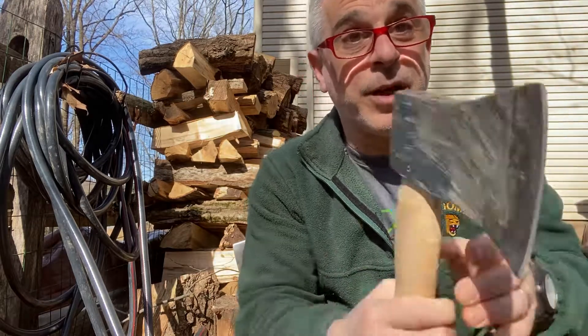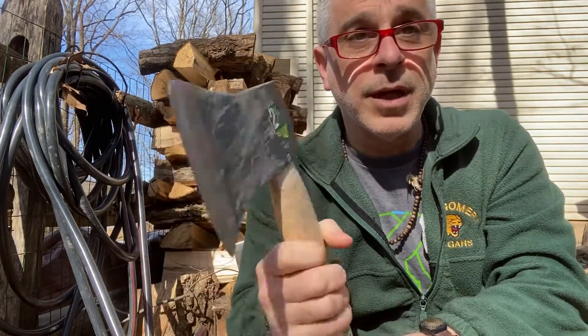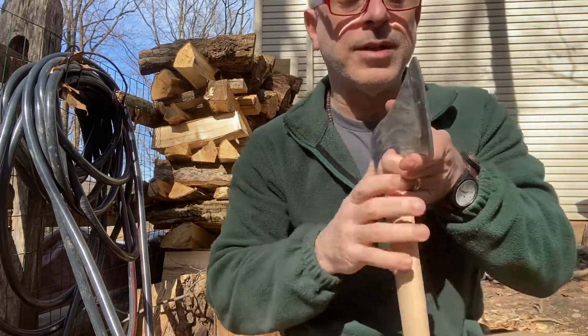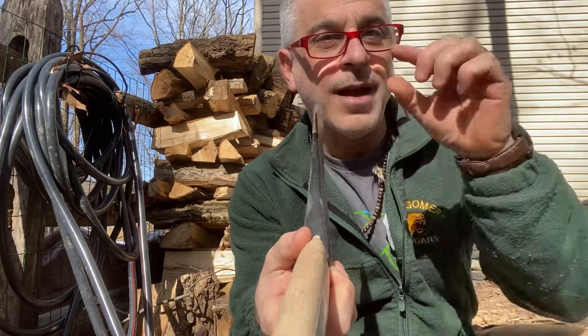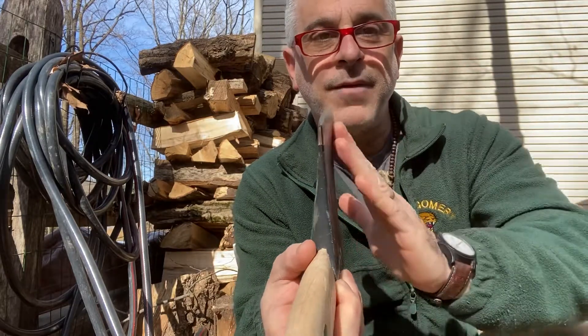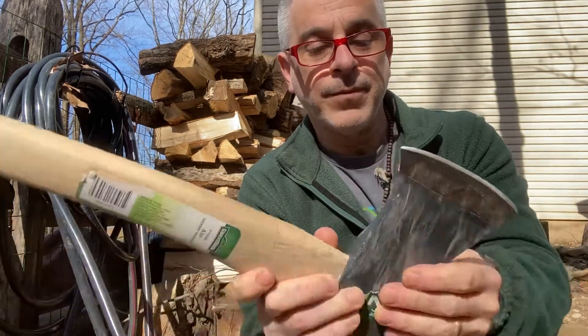The bit seems good, the edge is good. I've been splitting firewood for the wood stove with it and it's working great. I'm going to touch up the edge — I haven't done any sharpening yet — but it comes with a pretty good edge. My only question is the steepness of the bevel. You don't want a big chunk of metal that goes real violently into the point, because that point is going to get worn down. You want that more narrow profile.